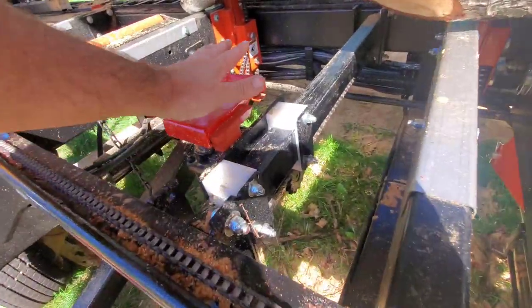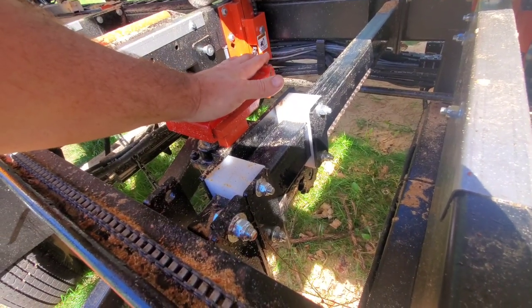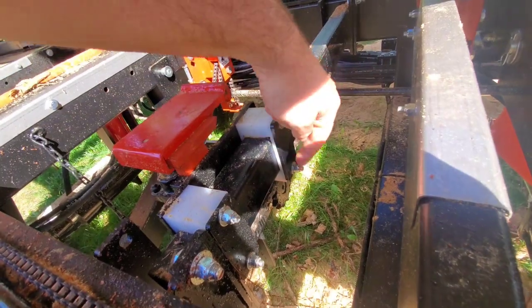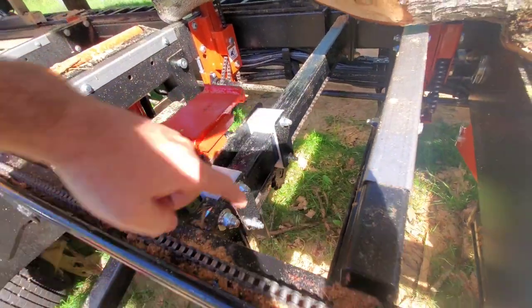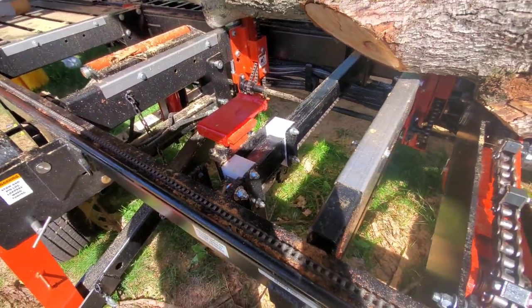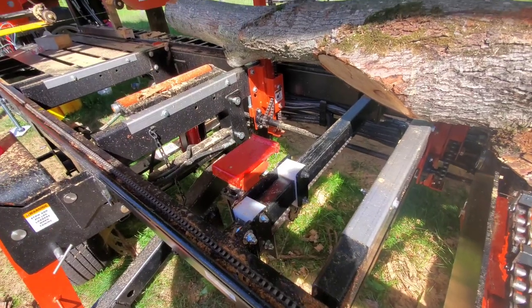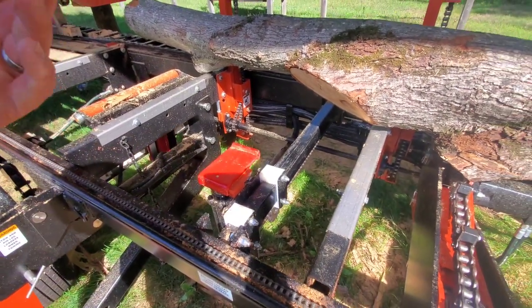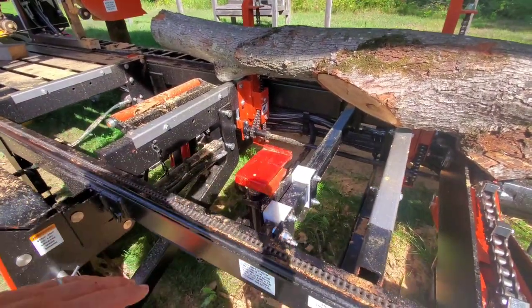Same thing on your log dog in and out — there is a chain on the bottom that is often neglected, and there's a sprocket right there. Spray it down. It won't hurt anything; it'll only help. It decreases the coefficient of friction and prevents metal from shearing away.